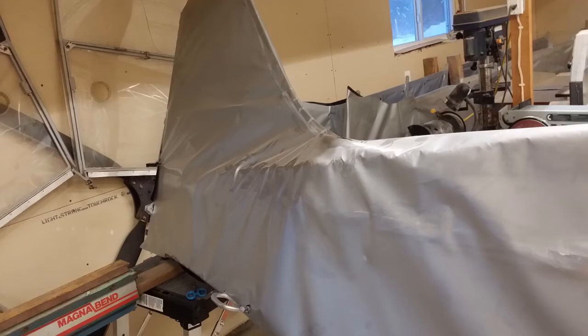And this is what was actually really stressful. Oratex says working with Oratex is fun. Well, yeah, maybe not. I found this part super, super stressful, because it was a lot of material and I didn't know if it was going to turn out. And importantly, and we'll talk about this later, right around where the vertical stabilizer starts, I'll just circle it right here. Okay, there's a massive amount of tension that goes in there. And it was always kind of a trade-off: do we put less tension in there and let everything else go slacker? I'll explain how we did that in just a moment.